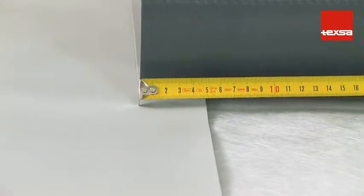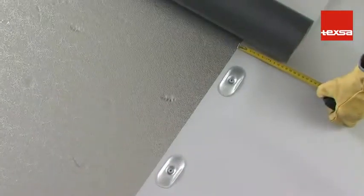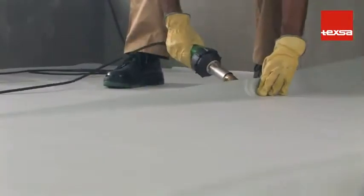Joints. Welding roofing membrane by hand. Once the equipment is ready, unroll the roofing membrane. Leave an overlap of at least 5 centimeters. On mechanically secured systems, the overlap should be 10 centimeters, so the fastened area will be completely covered. It is recommended that the membrane be secured with spot welds every 50 centimeters.